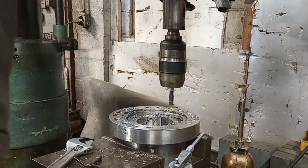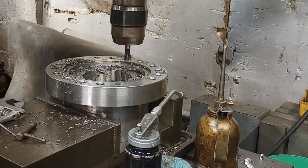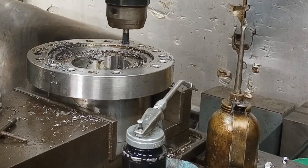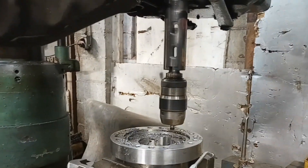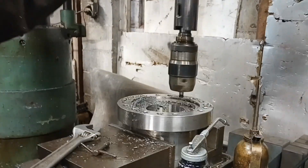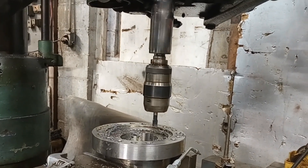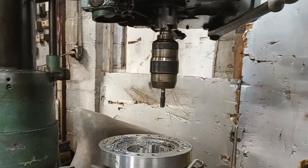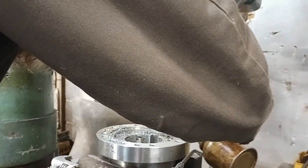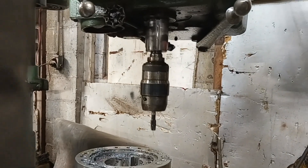This thing is the shizness, let me tell you. You can see there, I just kind of keep up with it a little bit. Daddy, why don't you tell them what happened when you first tried it — that tool thing came out. Yeah, I pulled up too hard with it and popped it out of the Morse taper shank on the first try. It's supposed to have a keeper key in it, and I didn't have one in it.